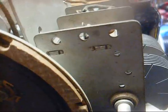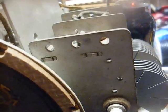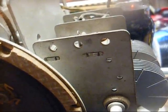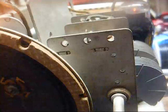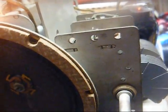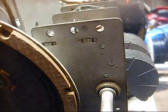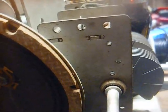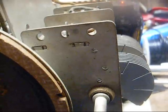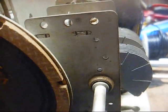1390 is just so hot that it's unlistenable. And that's just because they're so overmodulated, and now that the set's aligned properly, the signal's so hot it's more than the set can handle. And they have an FM translator, which, like other AM stations that have FM translators, the FM sounds a lot better than the AM. And I think what that all boils down to is a lot of these stations are not even keeping their AM stations up. They're just keeping them on the air just so they can legally have the FM translator, and they don't give a crap what the AM sounds like.